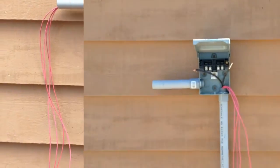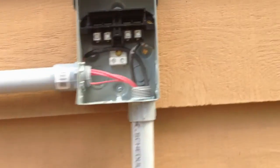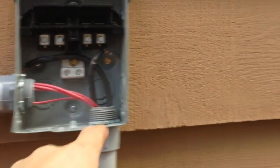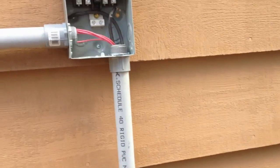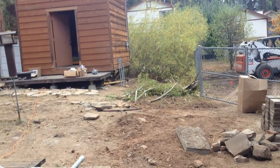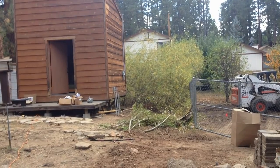Now we're starting to wire up here. Disconnect prepped for adding panels later — I think I'm going to need it. This has our DC inside, so we're set to bring down the DC and add panels. This will feed in through the conduit, go underground, and then through that middle conduit that enters the shed. This is the meter inside, and these four wires go down the one-inch conduit, run in a two-inch with everything else, and then enter into that middle conduit that enters the shed. That will go into the shunt.